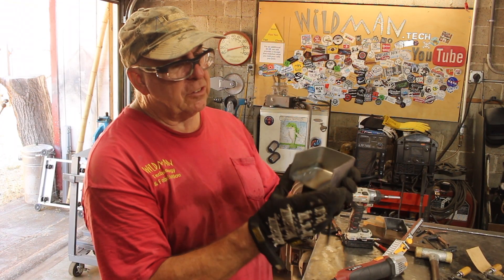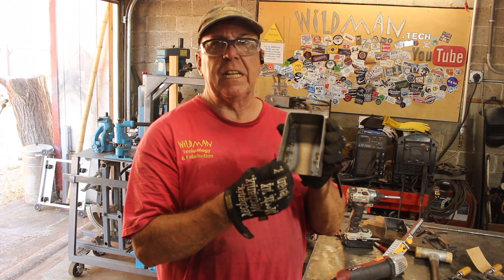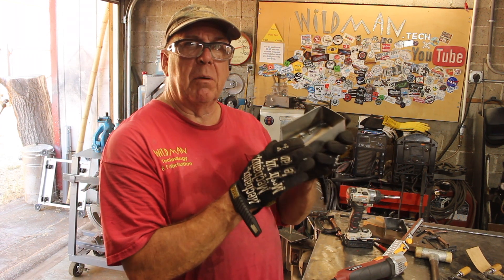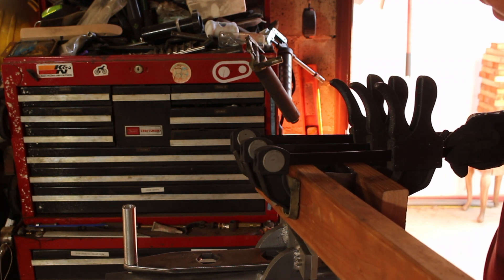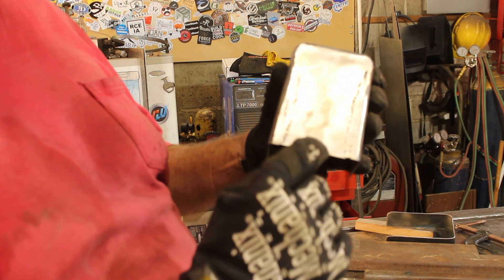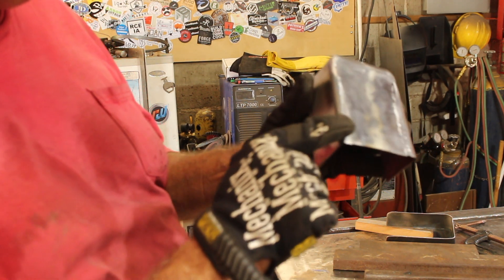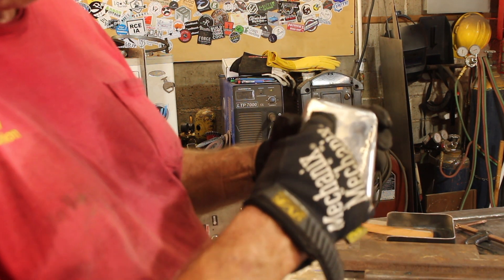It's not too bad — it's a little bit misshapen. I'm going to clean it up so I've got all the welds cleaned first, then we'll shape it back into the right shape. The heat warped it a little bit, but I think we just bend it back. Alright, that's looking good. The fact of the matter is I don't need all this backing plate at all, but I did want to capture that rounded edge around the whole perimeter — that's why we built it. Now we'll cut out what we don't need.